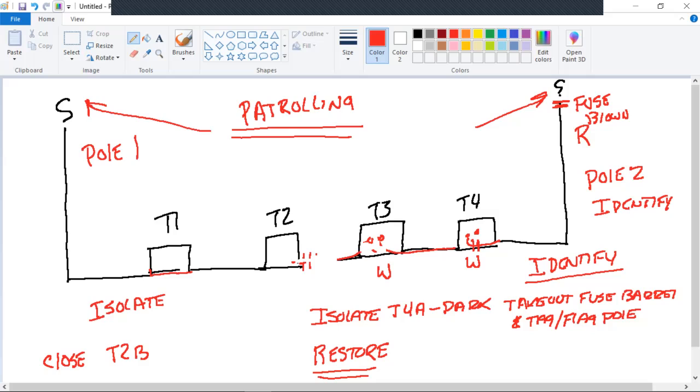This is where it gets kind of confusing. Because this came from the other direction, it actually goes in B to start with, and out A. Then it goes into B, and supposed to be out A, but we've got A isolated. That's what gets most of the guys out there in the world. You've got to remember the left to right, right to left, A and B's coming from a different direction. And that's where somebody puts the wrong one in the wrong hole.